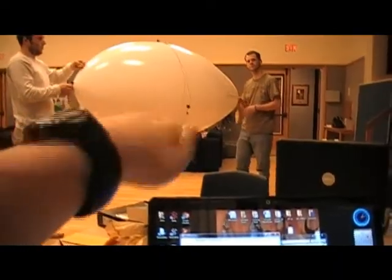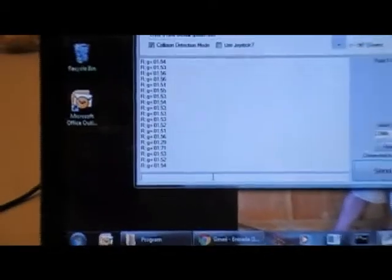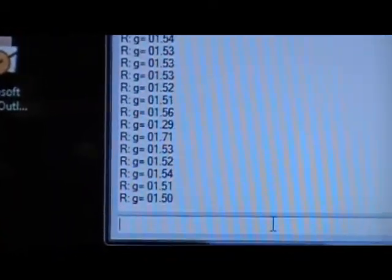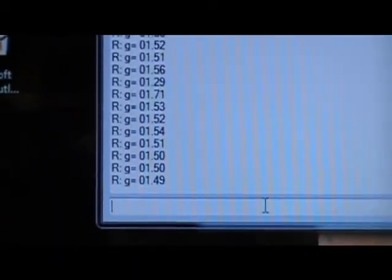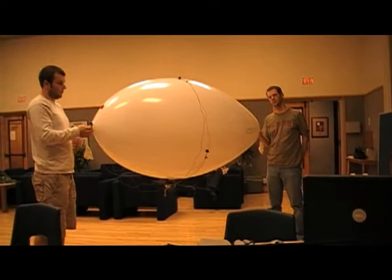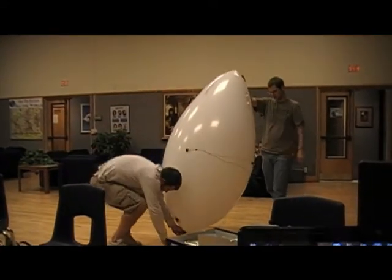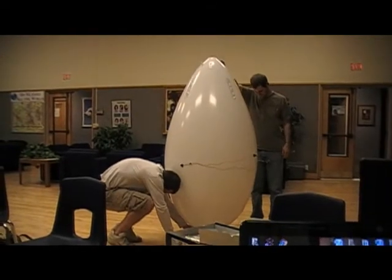the actual horizontal acceleration can be overshadowed by contributions from gravity as the x and y axes tilt slightly towards the Earth. This can lead to a very large integration drift, making a true dead reckoning system impractical for our application. For these reasons, we decided to switch our primary position tracking model to being based on the gyro heading in conjunction with propeller velocity.